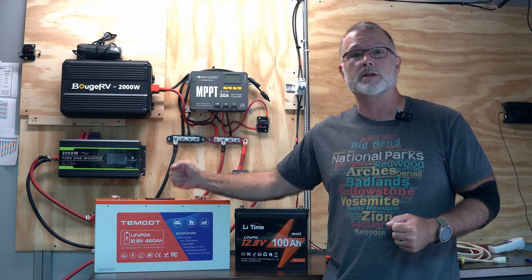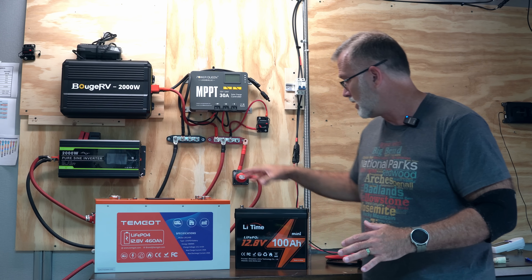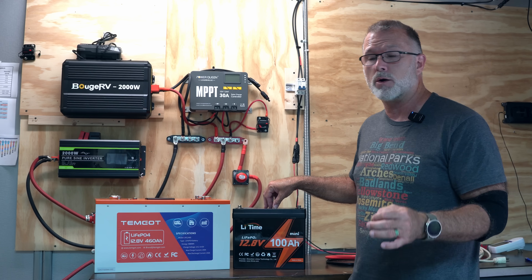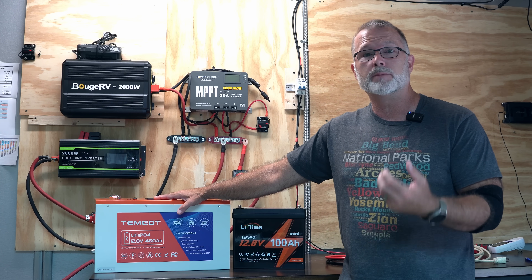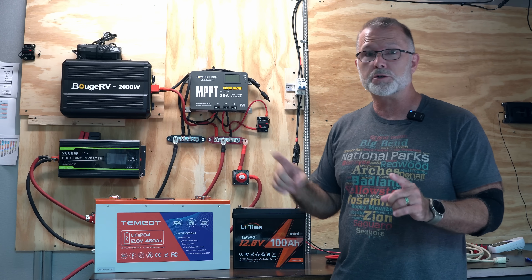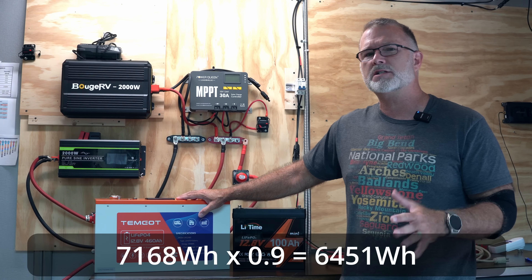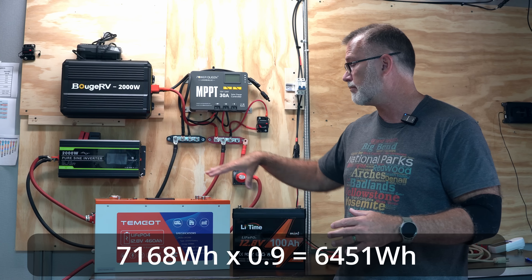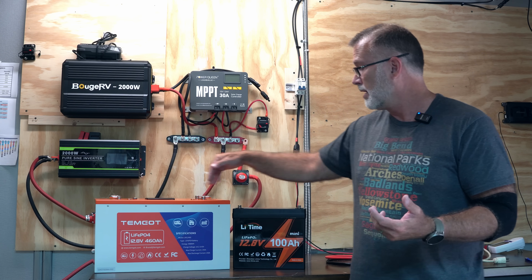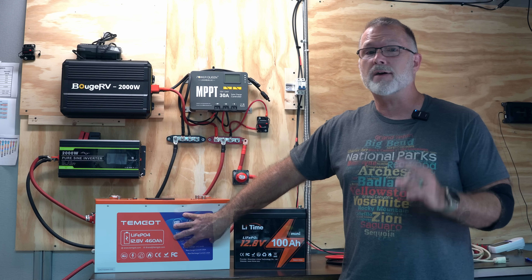This battery is rated for a whopping 460 amp hours, which should equate to about 5,888 watt hours if I get the full capacity out of it. This one, as you might expect by the dramatic size difference, is rated for only 100 amp hours, or roughly 1,280 watt hours. So if I add those together, I would get a maximum total output of about 7,168 watt hours — that's the best case scenario. If I'm going to do a capacity test through an AC inverter, we should get about 90% of that 7,168 watt hours, netting around 6,400 watt hours after accounting for DC-to-AC conversion efficiency. So we're going to try that and see if we can get at least 6,400 watt hours, even though these batteries are dramatically different in capacity — this one is literally less than a quarter the capacity of the other. Let's find out what actually happens.